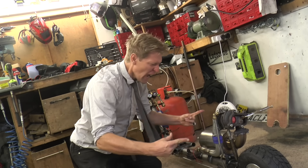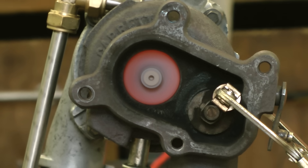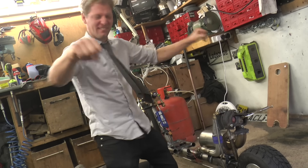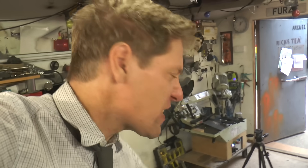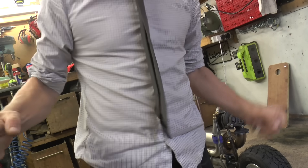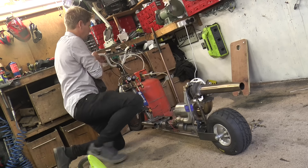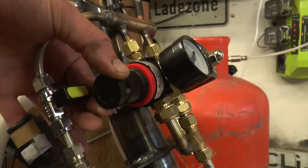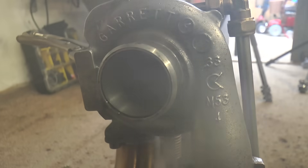Yes! Yes! Yes, it's running! It looks a treat and it sounds brilliant, but it has no power! Let's try putting the nozzle back on there. Yes! Right, so it works — we've got it running, but it doesn't produce much thrust, and if you try to rev it highly it just seems to vibrate and spit oil everywhere.